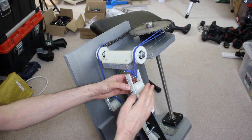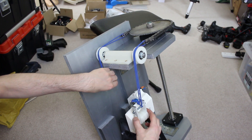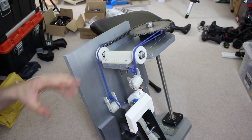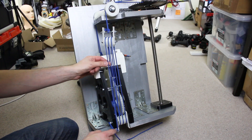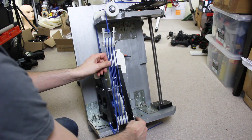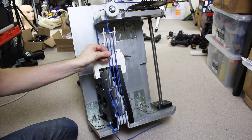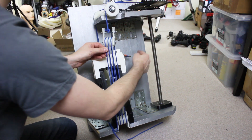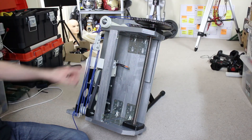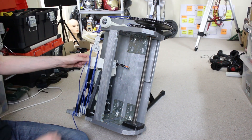We need to attach it with something flexible — ideally steel cable with a proper coupling — connecting to the other half of the block and tackle. But since I might change this for a pulley, there's not much point going to the trouble yet. I'm stringing up the blocks and tackles, and I can see these sides bend towards each other quite a lot under tension, so I'm going to need to put a cross brace in there. After installing an additional cross brace with a couple of brackets, those don't get pulled together at all — now I can tension it up and run it.